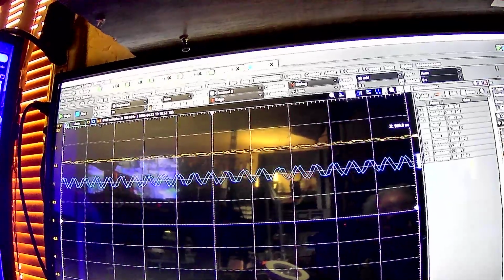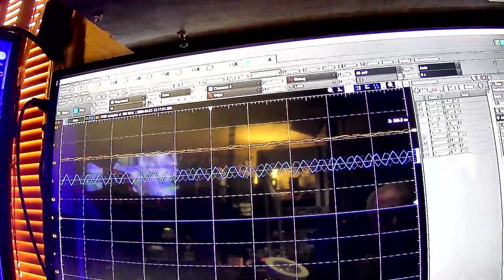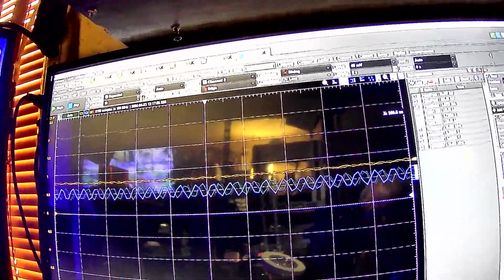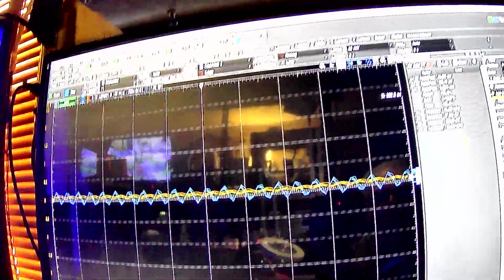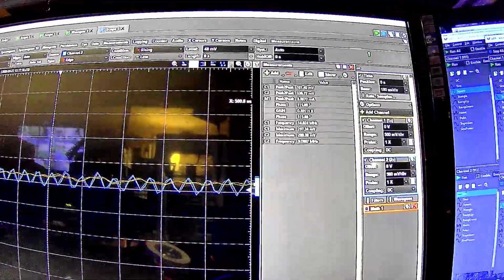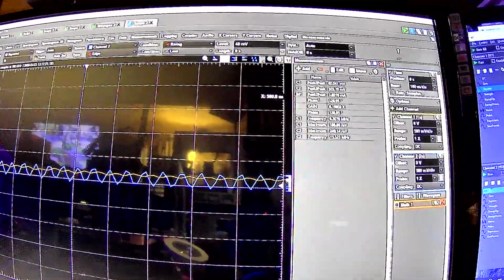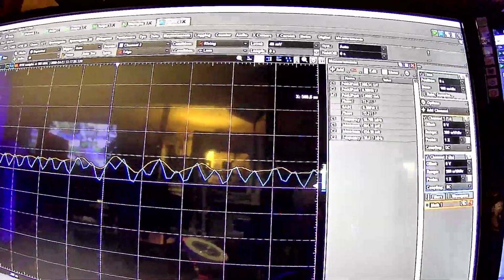And so let's go down to half a volt instead of 1 volt that I had it set at. Oh, guess what? This thing's still working. It's actually still working at 22 megahertz, as I'm changing this offset, 100 millivolts, etc. It's still detecting the fact that that's a sine wave, and it's looking at that offset. I'm just surprised this thing's responding.